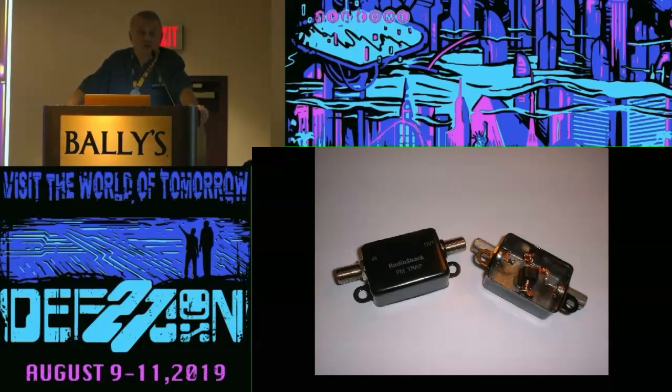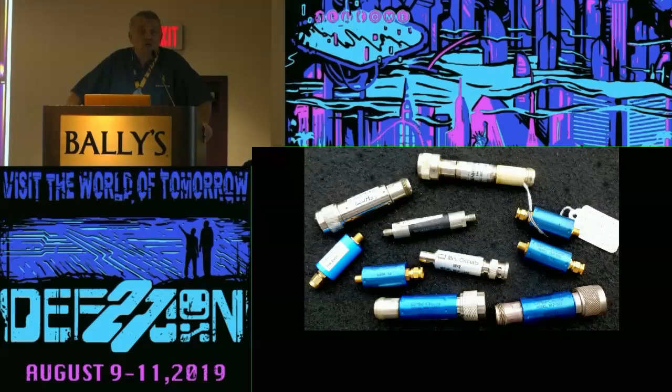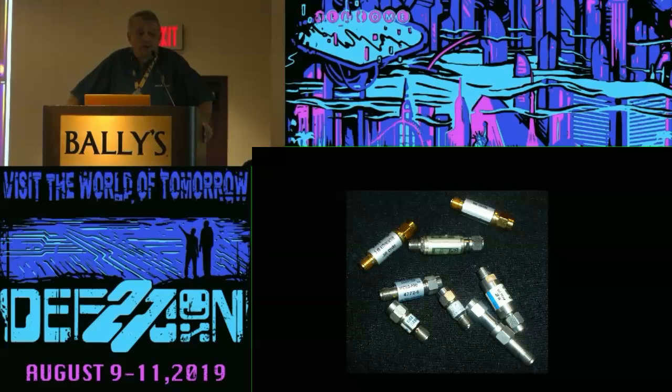No Radio Shacks anymore, but there are a couple of these floating around. Also, don't be afraid of 75 ohms. When I connect a 50 ohm to a 75 ohm, I get about a 10% loss due to impedance mismatch, but the 75 ohm coax has so much less loss that you're probably ahead in the long run. Mini Circuits makes entire families of filters, and it starts becoming important if you're doing serious work to filter out everything except what you want. I also wouldn't rule out low-value attenuators — just a 1 or 2 dB attenuator in front of the radio is often enough to make it linear again.